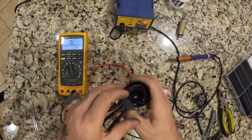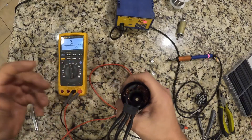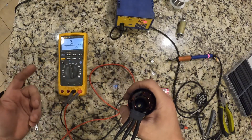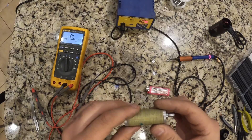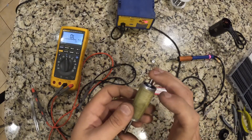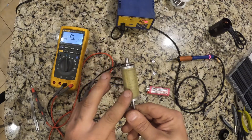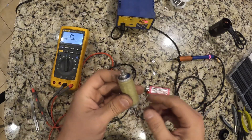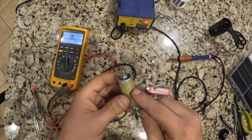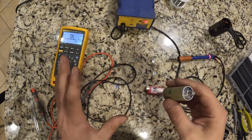Nothing is overheated, the windings where they're soldered together are protected, and we should be able to put this motor back together and run it. Before you put your rotor back in the motor, look it over and verify there are no metal particles, washers, screws, or anything stuck to the rotor — because if something is stuck to the side and you put it together, when it runs it will destroy the whole thing.